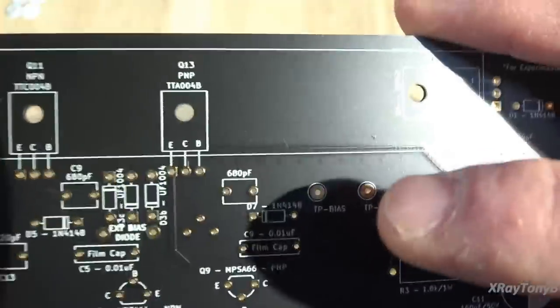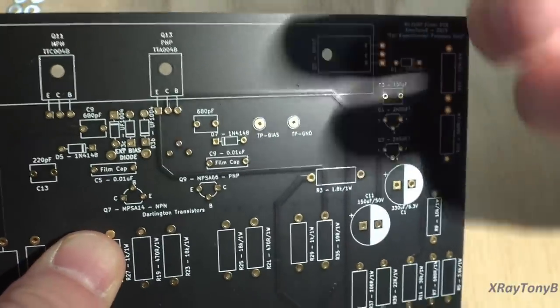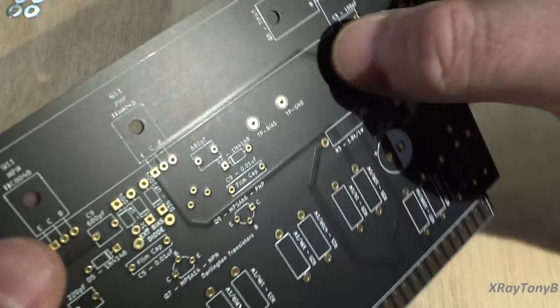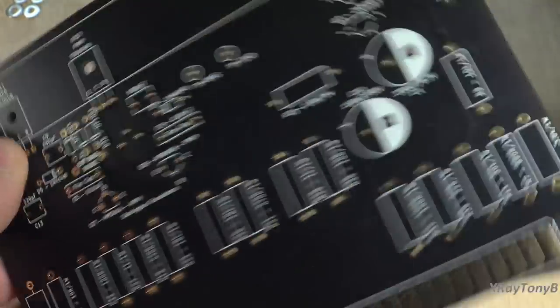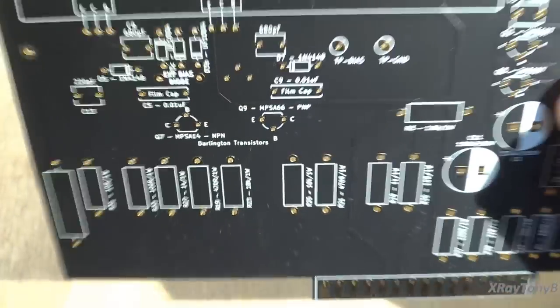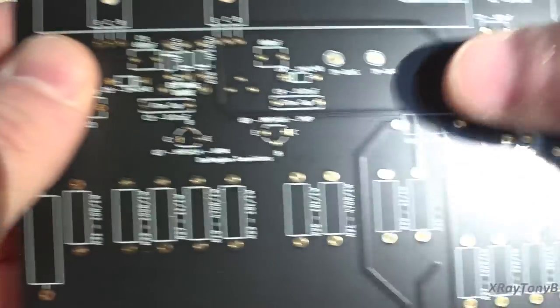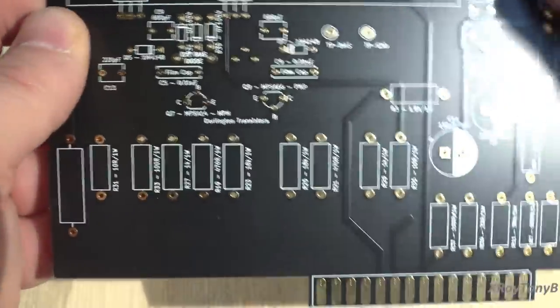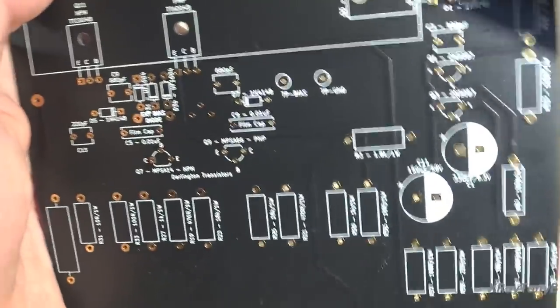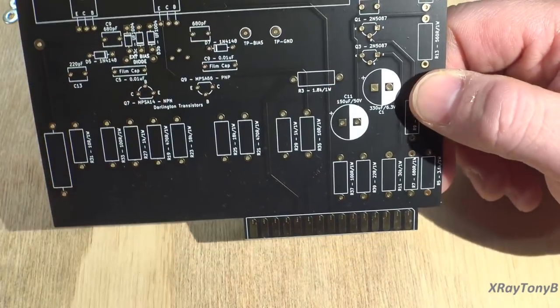I need to check some better photos of the original board. There's a metal standoff attached somewhere in there to brace the board to one of the heatsinks, and I don't know if my traces are going to interfere with that position. We have plenty of real estate on this board to move things around — if we need to slide a trace or component a little to the right or left to allow the exact spacing for that standoff, we can do that before we place a batch order.